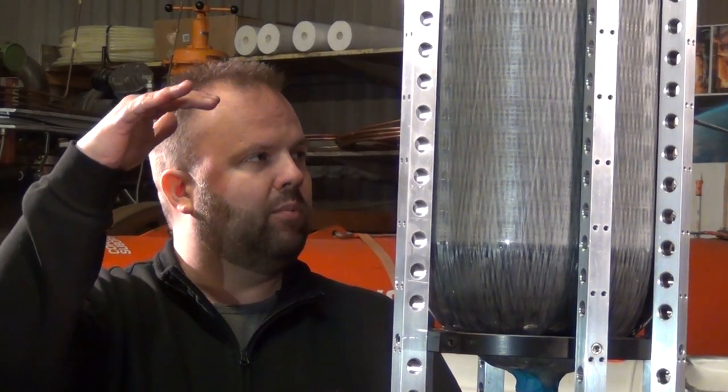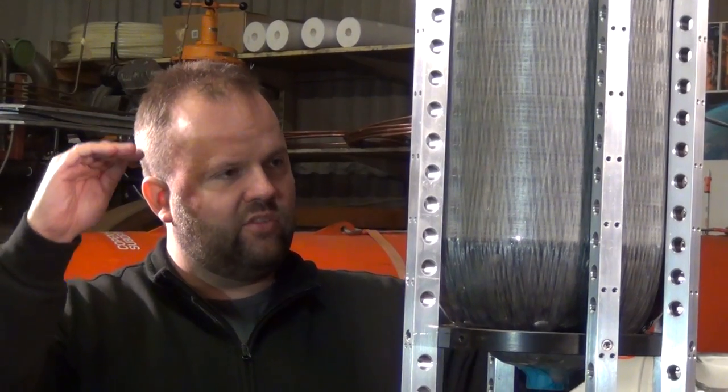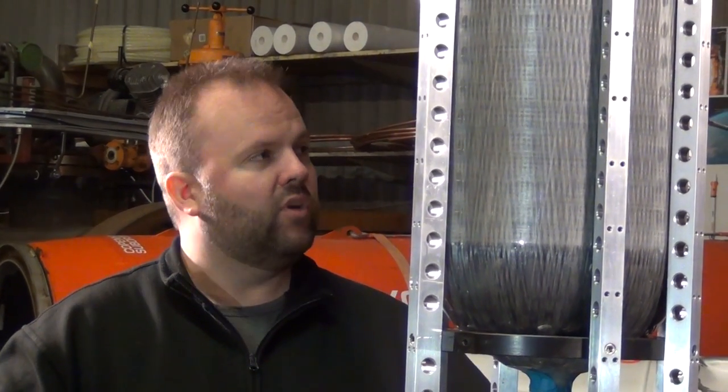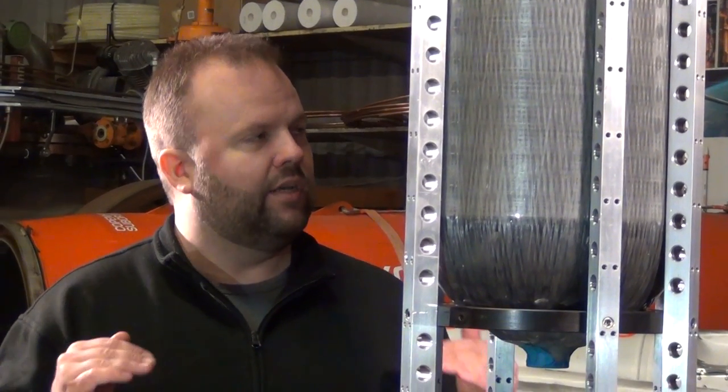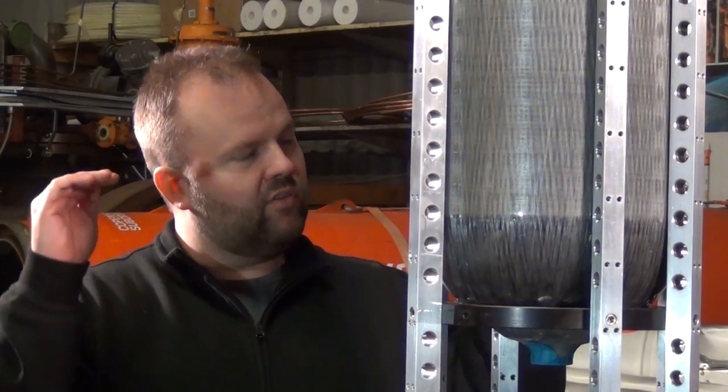The helium is something we use to pressurize our tanks. We did that on Nexo 1 — filled the tanks about 55% and then had this helium gas bubble on top. That's what forces the propellants out of the tanks and into the engine. Unfortunately, once we start using the propellants, the pressure drops in these tanks. So from the very second we push the start button, the performance of the engine decreases all the way up. So if we bring some extra helium — this is where the DPR section comes in — we can replenish all the helium that expands in the tank as the propellants get into the engine. Furthermore, when we bring the helium in a secondary compartment, we can fill the tanks more or less to the rim, so we get a lot more from this.